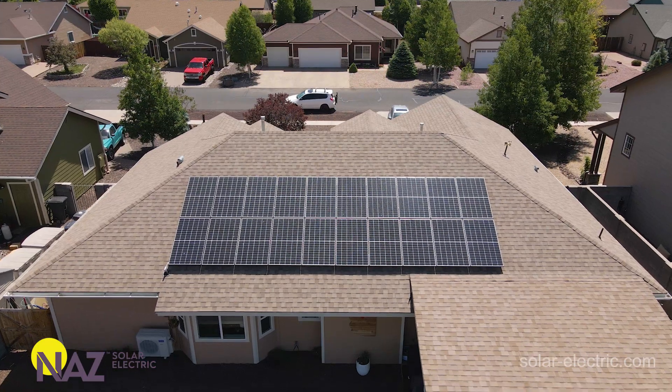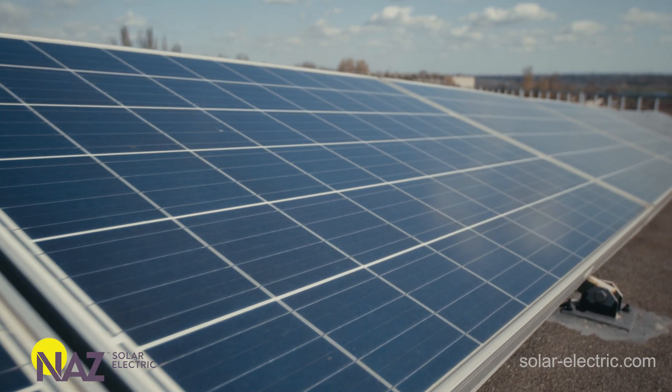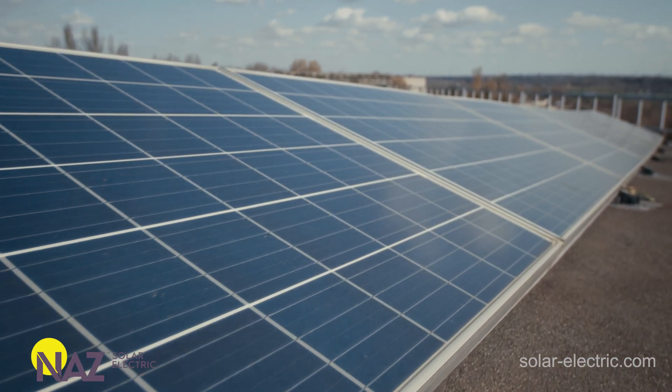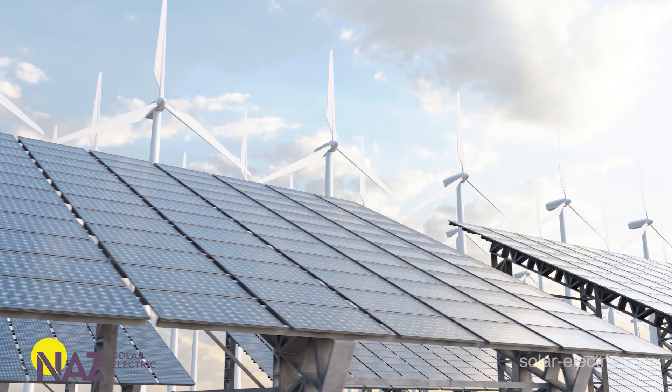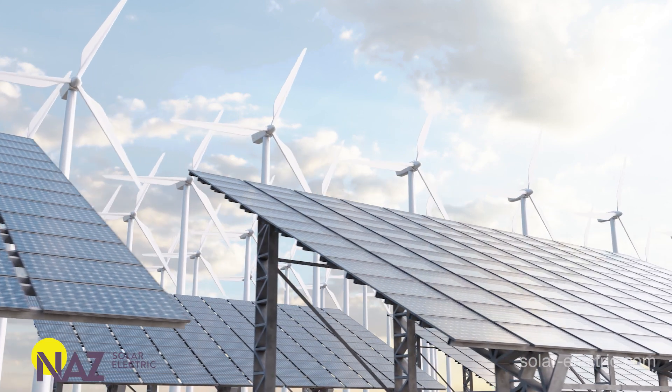These types of solutions can be used in residential, commercial, and even larger utility scale ESS platforms. At utility scale, they're almost exclusively AC coupled because there's a huge bias on AC production. The main goal of PV power in those applications is to literally offset the grid, so AC takes priority and battery charging is supplemental.